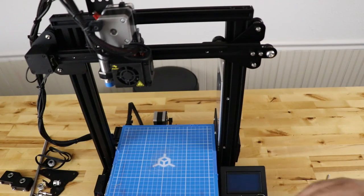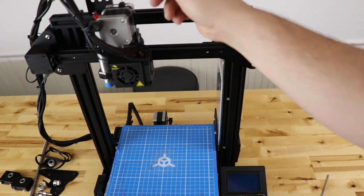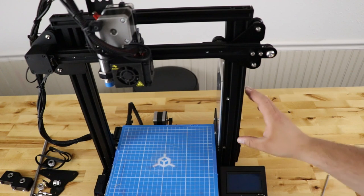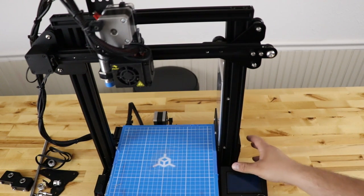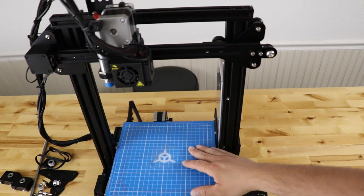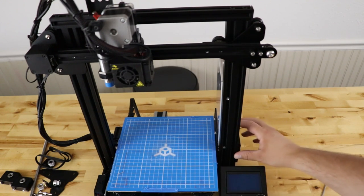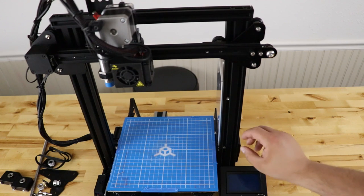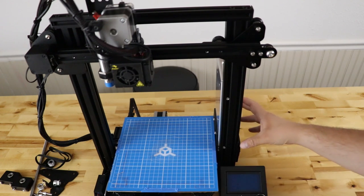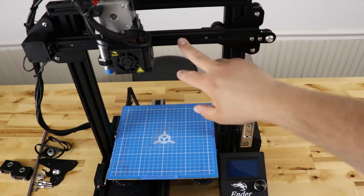Let's get to the install. First, make sure your filament is removed from the machine — I just cut mine, but you can heat it up and pull it out if you prefer. We also need to relocate the power supply. I'm setting mine on the desk for now, but during the first print I'll print the relocation file from the instructions page. Remove the two screws with the allen wrench from the kit, set the power supply to the side, and make sure your x-gantry is all the way up when you do this.